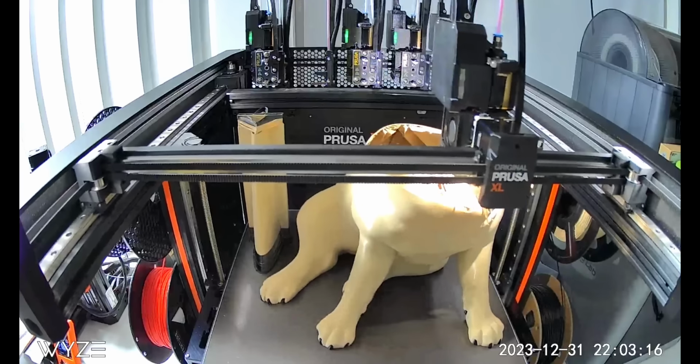On my Dragon, I had it fail to remount the tool changers, but I've never had it just fall off like this. But I am glad that it did notice that there was an issue and didn't try to keep printing and jamming it into another tool head or anything. It did pause itself. So I try to just put the tool head back in place, but it doesn't seem like it's recognizing that. So I just unhook it and put it back on its regular mount on the back.